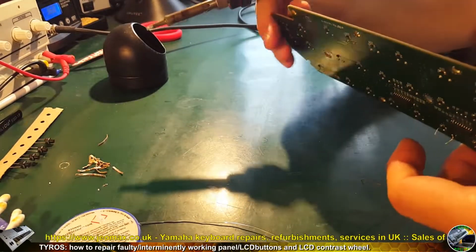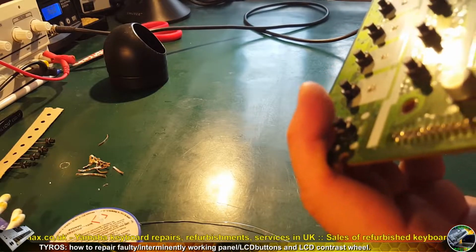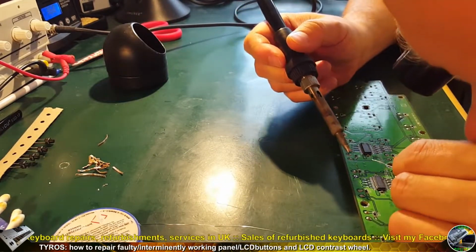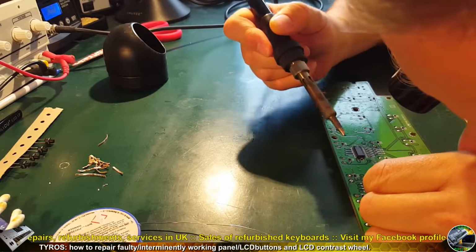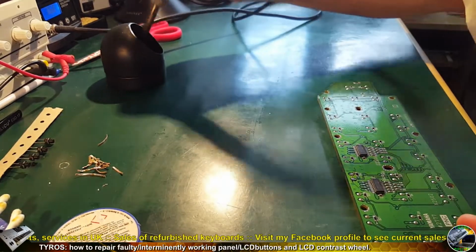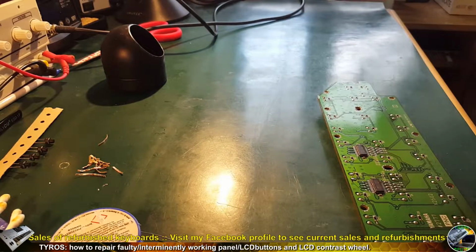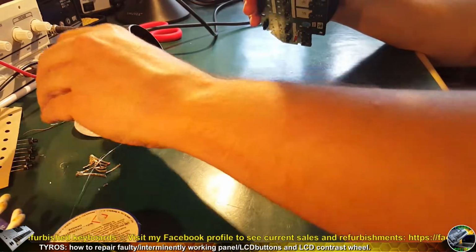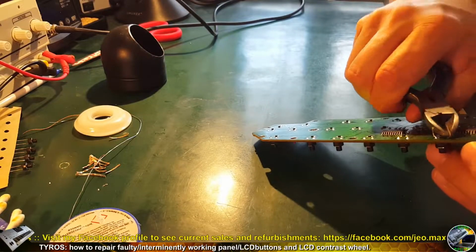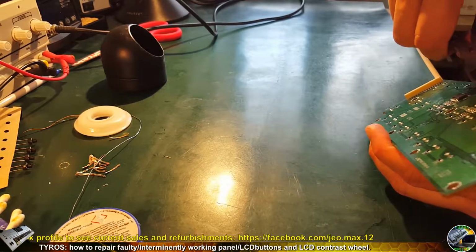And second terminal. Before doing this, you might want to make sure the first terminal is soldered properly and the whole switch lays down on the PCB without any additional height. If so, you may solder the second terminal in. A quick job, like so. So now you can cut off the remaining terminal, because it doesn't have to be so long. Yeah, like that.